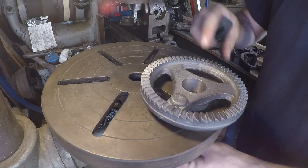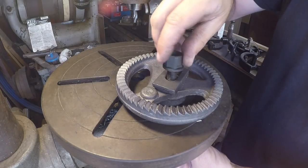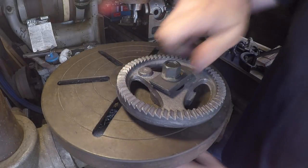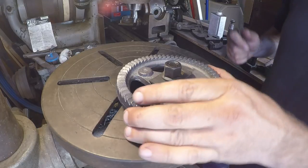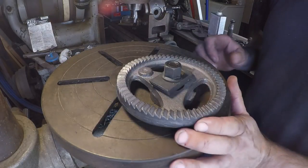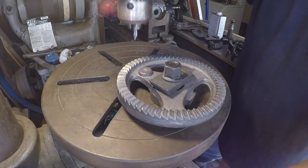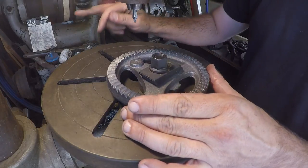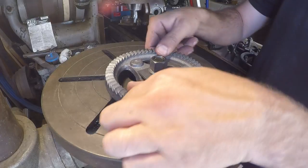I'll take our hardware, slip that in, and this has got a couple of feet on one side so I'll put that side down. Is this the right size wrench? Look at that. I'm going to tighten this here but I want it pretty snug — that ain't going to go nowhere. Whenever you work on the drill press, everybody gets lulled into being relaxed about just holding the part, but sometimes this stuff will grab hold of it and you're just not going to be able to stop it.